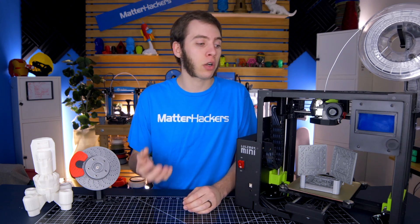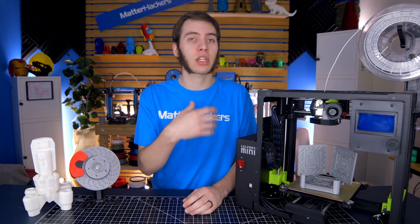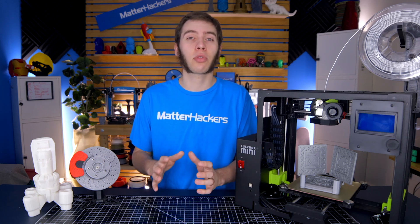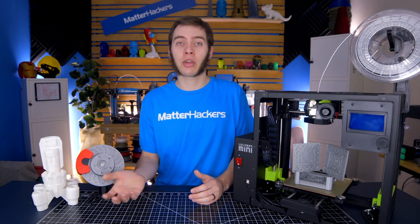While some printers are fully capable of moving at really fast speeds like 100 millimeters per second without any artifacting, you may have complications with getting previous layers to stick to the new ones or the material to come out as accurately as it should. So there are a couple of things you can do about that. The simplest solution is to just print hotter. Some materials like more temperature than others — like if you're printing black, you may need to print it higher than you'd need to print natural PLA.